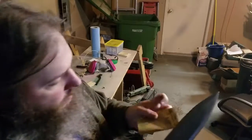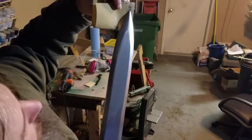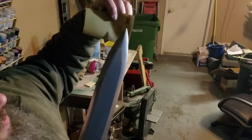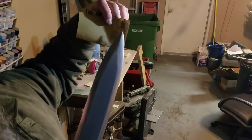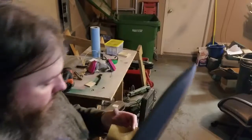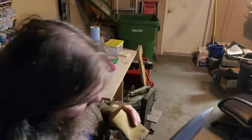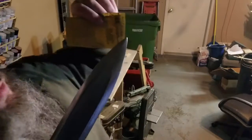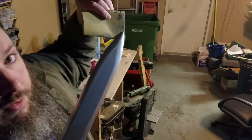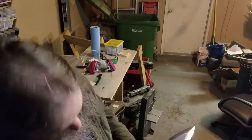And I created powder. Now, look at the sandpaper, you're going to see two spots on here. Spot number 1 and spot number 2. This is where I was sanding right here. This is where I did something else before. I was just trying to get it done real quick, so I used a lot of pressure, and that's what caused the gummy flakes. And there's even some gummy flakes, get that back in the light, right here. It happens. That's why you apply light pressure.